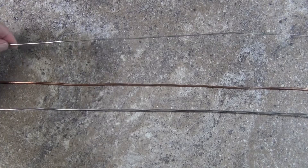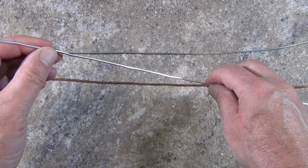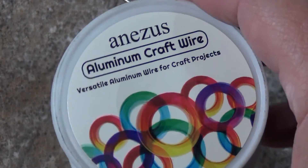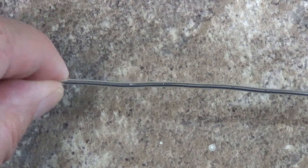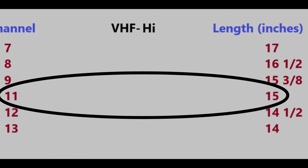I need to select a material to make the antenna's elements. For this design I will use some 14 gauge aluminum bead wire. I could have chosen copper or even galvanized steel, but I think the aluminum will work well. I want to really enhance this antenna's gain, so I will make a 3-wire bundle wrap. Since this antenna is a dipole configuration, I'm tuning it to receive channel 11, so I will make each dipole 15 inches long. At that length, it will be able to receive any good signal in the VHF high range.